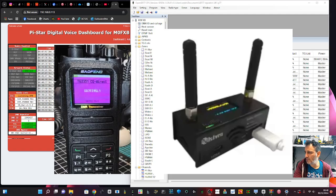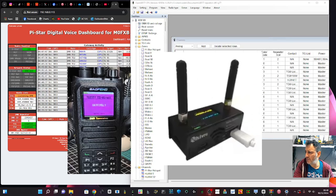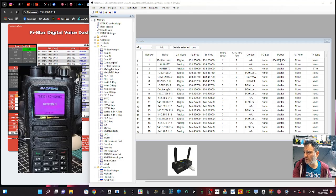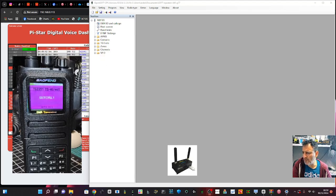Let's add our dual hotspot to our DM1701 model. The cable is connected to my PC. This is the hotspot - I'll provide a link in the description, it's about 70 pounds. It's a duplex or dual hotspot with two antennas so you can listen to two talk groups at the same time. Open GD77 firmware software on the right, Pi-Star on the left. Read your device normally - go to Program then Read. When you load the programming software it installs the drivers needed for this radio. Remember it will not work with a Baofeng or TYT cable - you need to get the one for the DM1701. It's not expensive, but when you order the radio, get the programming cable.